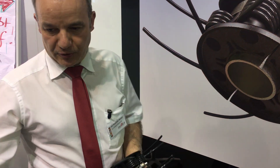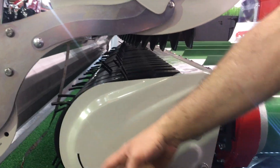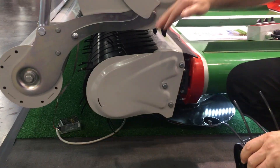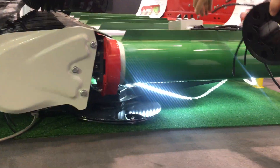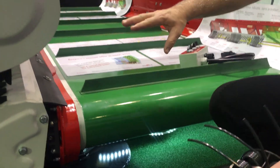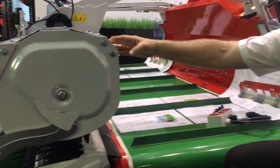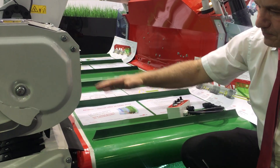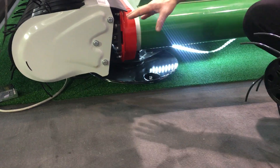It's a pickup that is without a grease nipple. The small diameter of the pickup allows picking up the crop very effectively. The roller guides it and the rotor itself will move the crop gently on the belt to ensure a constant flow and a uniform swath. The rotor itself is suspended hydraulically and moves according to the amount of crop coming in. Here you also see the gliding discs which guide the pickup.